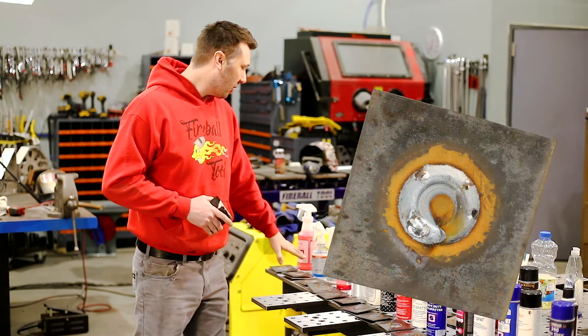Now I'm excited to test the internet-suggested anti-spatters from the pantry, closet, or right off an acetylene bottle. This test was performed on hot roll plate with the welder set to high voltage glob transfer. First up: glass cleaner — I don't know why it would work, but we're going to find out. Results: one, two, three, four, five BBs — did a little better than the control but not spectacular.